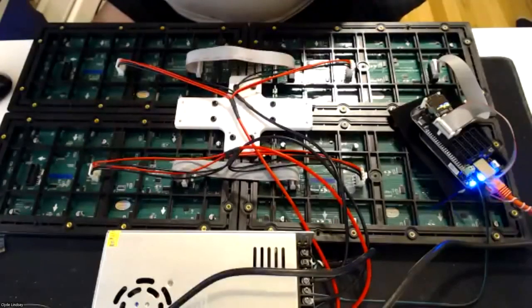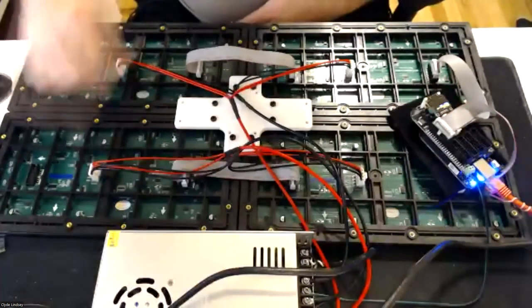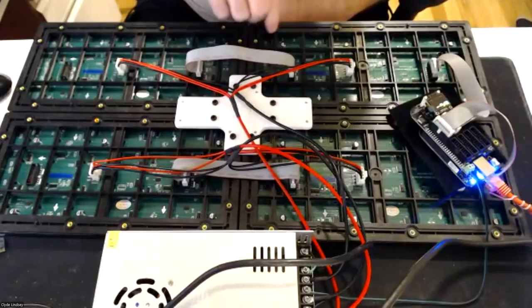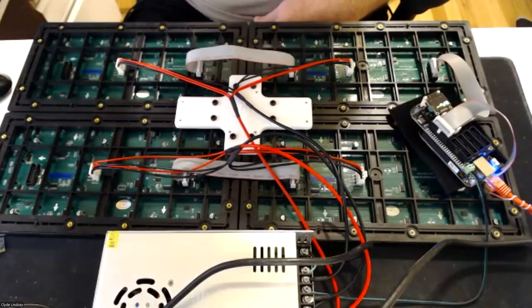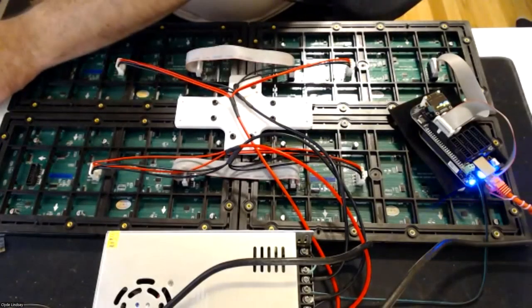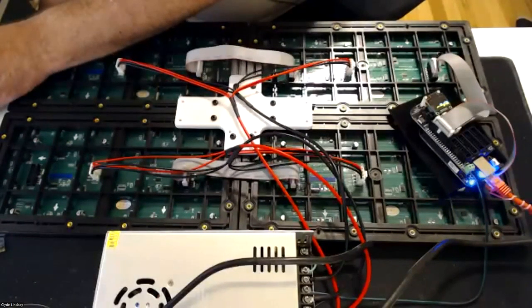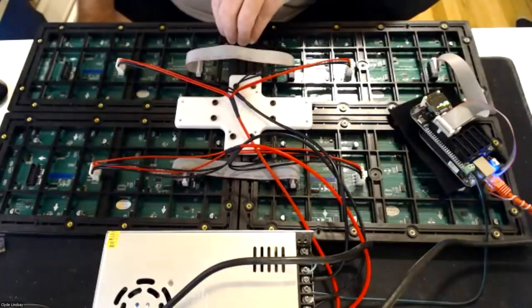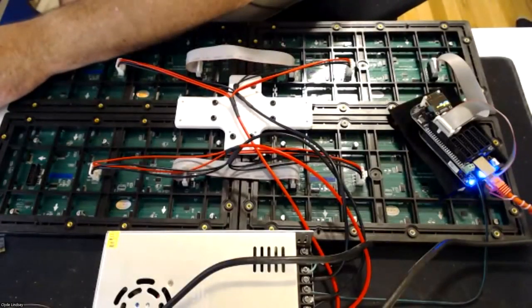Mr. Merlin Q. Potter said, the panels are hot swappable. It's on the data sheet, and the big dogs who do video walls and billboards do it all the time. So apparently that might be the case. If you have a bad panel, you could unscrew this, just disconnect it, leave the rest of it running, plug this in, screw this in, and your panel's back up and running. He's saying that because the bigger professional boards use magnets, and they suction cup to the front, pull it out, and put the straight in. True. That's right, because the mounts have magnets so that they can easily and quickly assemble them.